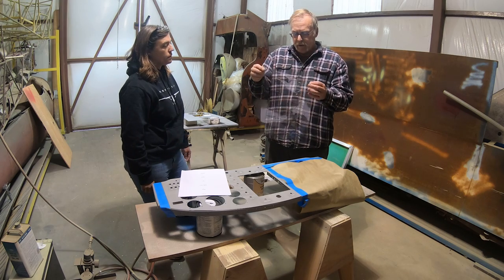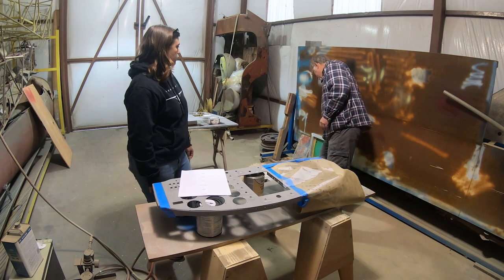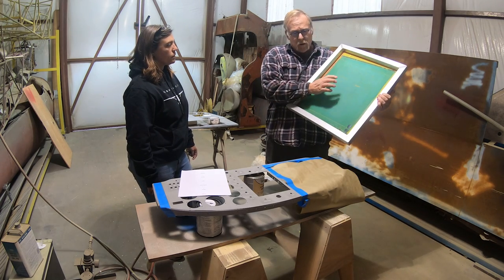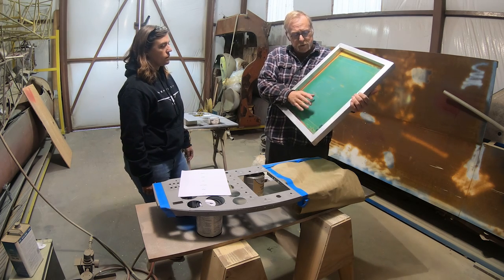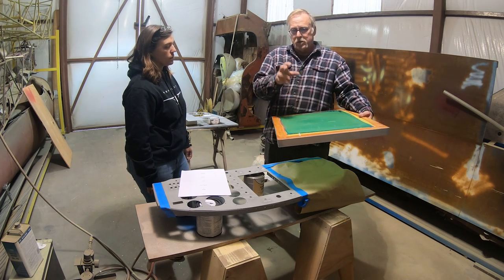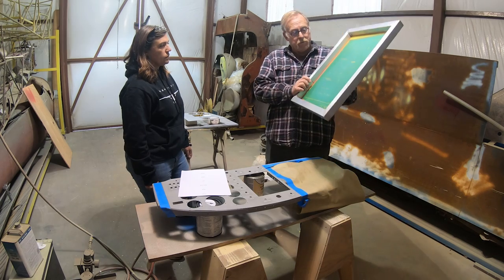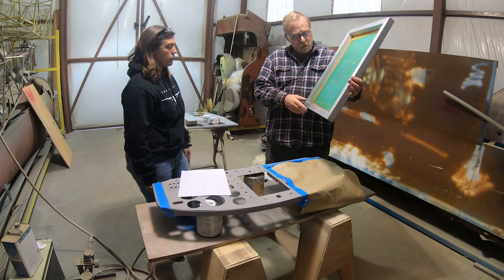It's like triple black ink, so that when we burn our silk screen, and this is the silk screen we use right here, we'll show you how I exposed all that. Essentially we put light sensitive emulsion on it, put that film positive on here, expose it, and what cannot go through the black gets washed out when we clean the screen. Then we have all the image we want. We can screen ink through these holes just like a t-shirt. So just like a t-shirt, easy peasy.